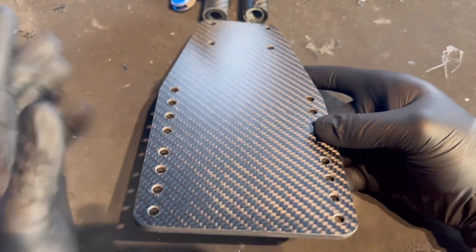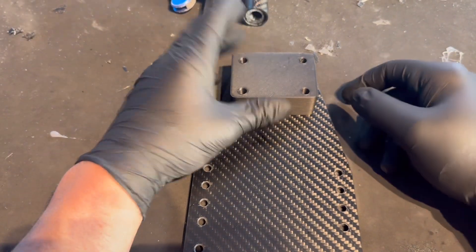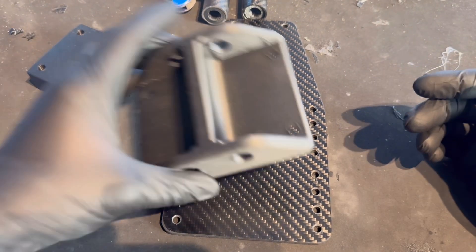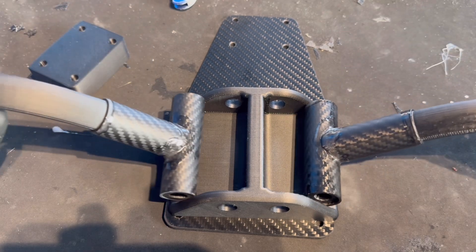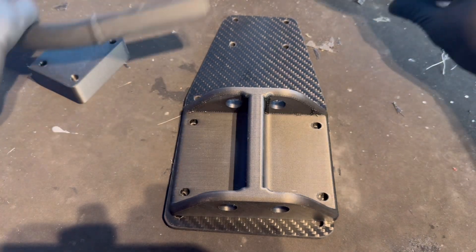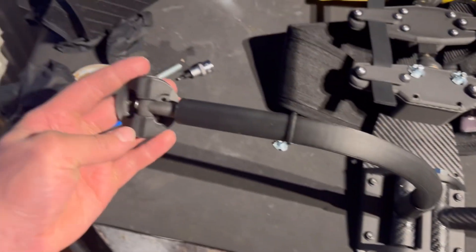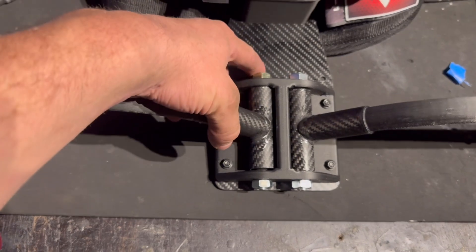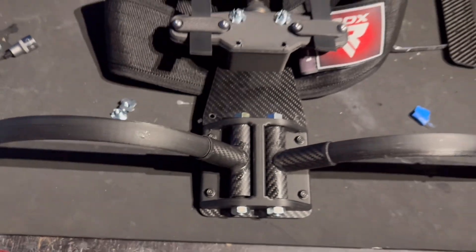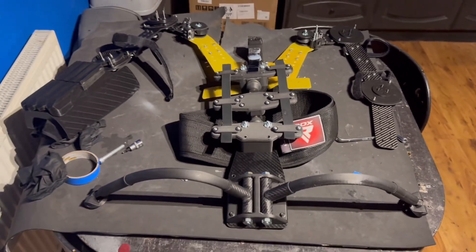We have the carbon fiber bracket - a fair chunk of five millimeters, which should definitely be strong enough; I can always double it up in the future if needed. We'll get the spacer block mounted on, then the mounting bracket for the arms bolted on, and then the arms will sit through the middle. And there we have it mounted - we've got the arms pivoting and the hub drives on the end. There is a little bit of play in here just because I didn't have the right size dowel, but I'll add it to the list of things I need.